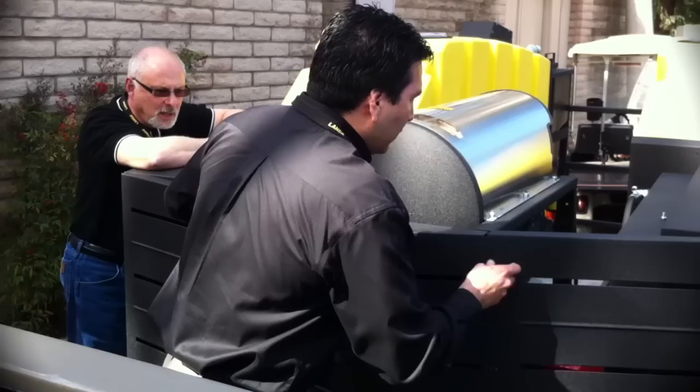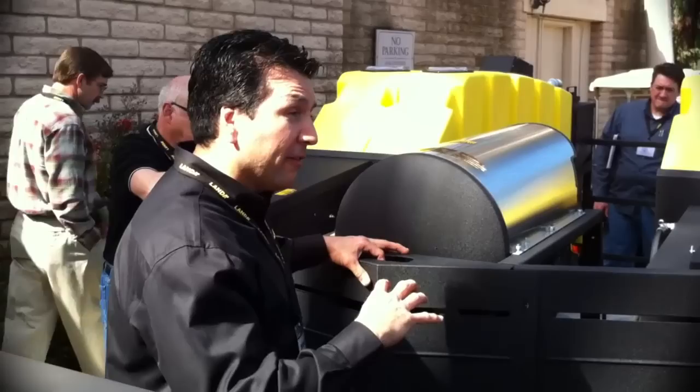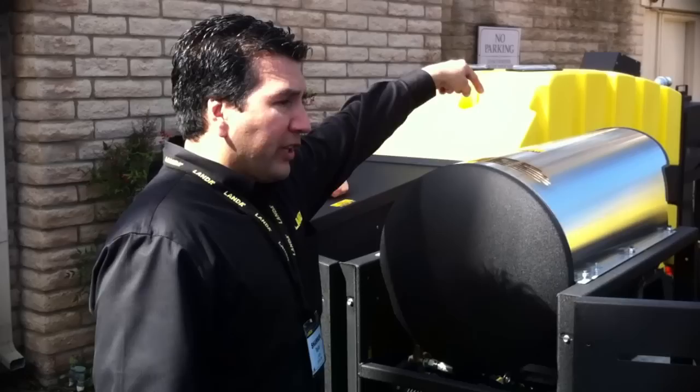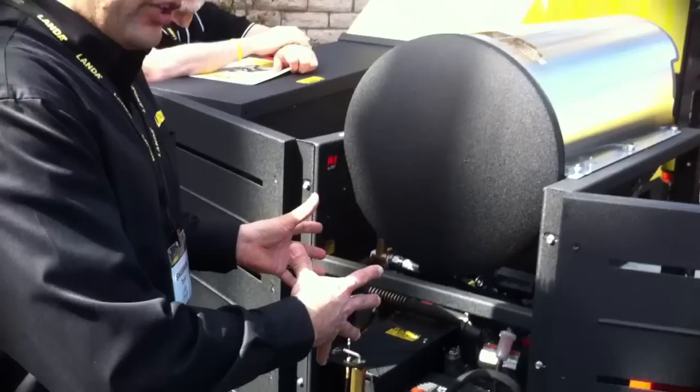The big comment from the previous trailer was serviceability — it was very tight. Once you got the panels off, it required a lot of bolts, and it was a one-piece panel design that made it difficult to get on and off. So here we made it with just one simple panel. Now you have full access to your pump, two oil drains, unloaders, and oil filters. For the generator and engine, you can go in the galleyway and everything is accessible from the back. If you need more space, you can remove these panels as well, which opens up the whole front.